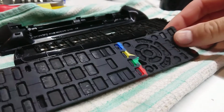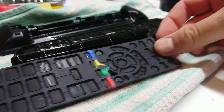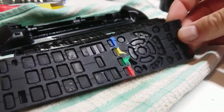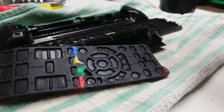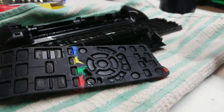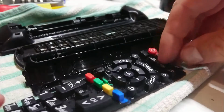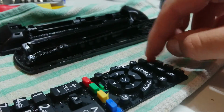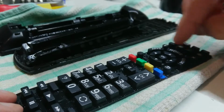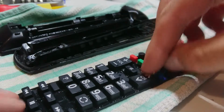Anyway, this is the keypad. Still a bit of damage to the carbon pads, but I'm not about to scrub them. If they have lifted bits of carbon off the other side, they might correspond to the holes, or rather to the damage on the actual circuit board. So they may be minimally functional if I don't bother. So I'm just going to poke all these down.